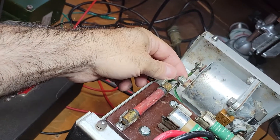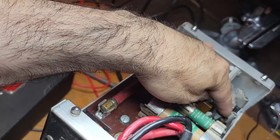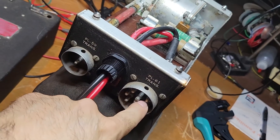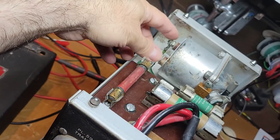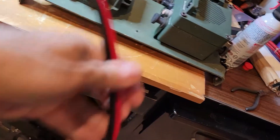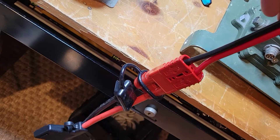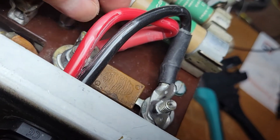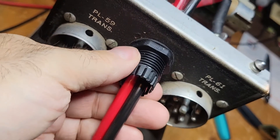On this side you've got a much smaller cable - this is where the 28 volts low current goes in to trigger the relay and then allows the high current to pass through. I'm just going to use my power supply like I did last time, clipping directly onto the pins to provide the low-current 28 volts to make it pull in. One other thing I wanted to point out: I'm using these 8-gauge cables I got from Powerwerx - P-O-W-E-R-W-E-R-X - which makes a lot of power pole assemblies.